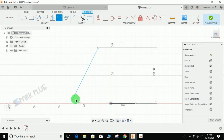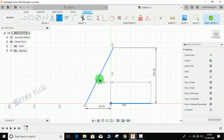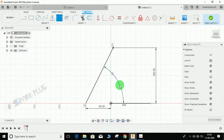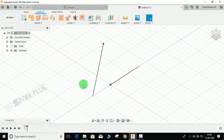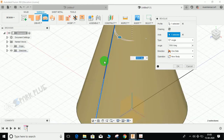Press D again and dimension from this point to assign the radius. The diameter is 100mm so the radius is 50mm — we are working on the half profile of the cone. The angle from this point to this line, as shown in the drawing, is 73.3 degrees. Set it to 73.3 and press Enter. Once done, finish the sketch. Go to Surface — we will not be extruding it; we will use the surface revolve command.